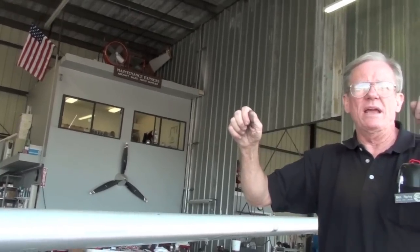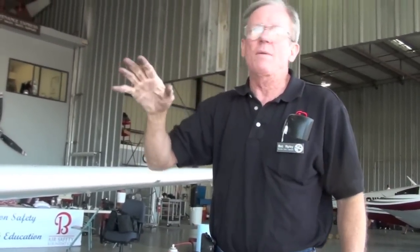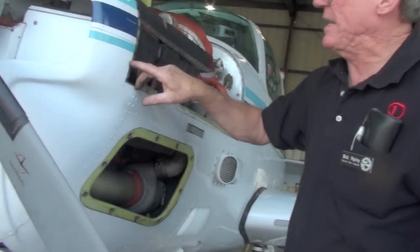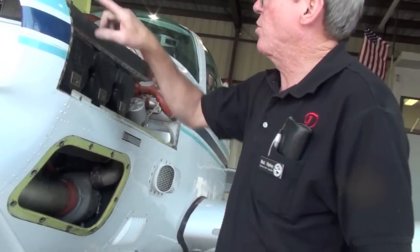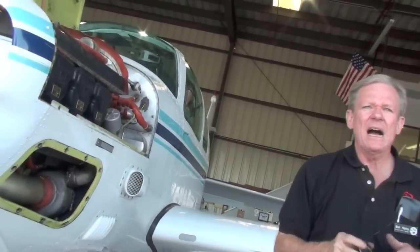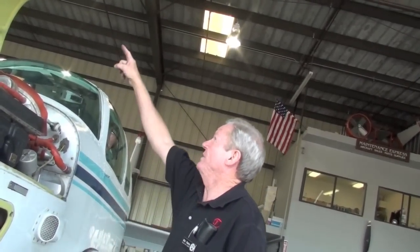But if you see it that way and you watch it pull down, what I would highly suggest is put a witness mark. You can take a little piece of tape and tape off a little spot here across both of them, about this long, and put a black mark. You can do it with a Sharpie. I do both sides. Great idea. That way you know the cowling is closed. Do the same thing right here. I love it. Okay, I will do that. I highly recommend that with Hartwell latches, because you can tell a latch is starting to fail when the springs are going bad in here or this is starting to stretch, because the witness marks don't line up anymore.